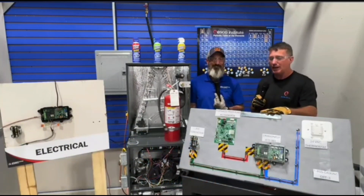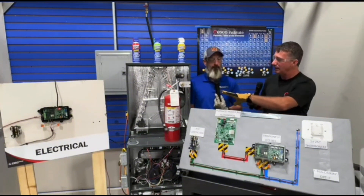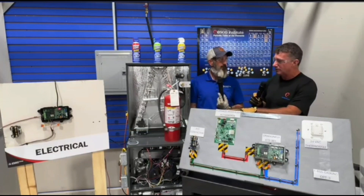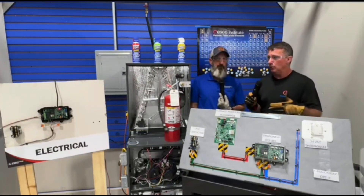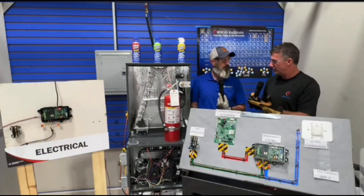You've done a fantastic job of putting together an A2L mitigation training board. We actually have a live A2L mitigation system hooked up with a Daikin R32 system, and we're going to show what the mitigation control is actually going to do once it meets that lower flammability limit where it detects enough refrigerant to go into mitigation.